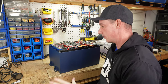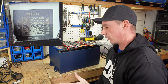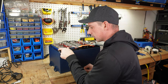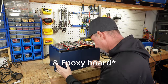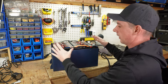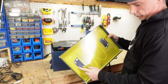As for the cells, I cut a little bit of this top piece back so I can see the QR code. I was not able to pick it up on my QR scanner, but I'll put a picture of it on screen — if you guys want to look into what type of cells these are, comment that below. I can also see some fish paper separation between each cell, and the two 24-volt packs are separated. All in all a very beautifully constructed pack. I'm going to put this back together. On the lid there's also a resin board for protection, and where the screws come through there is glue.